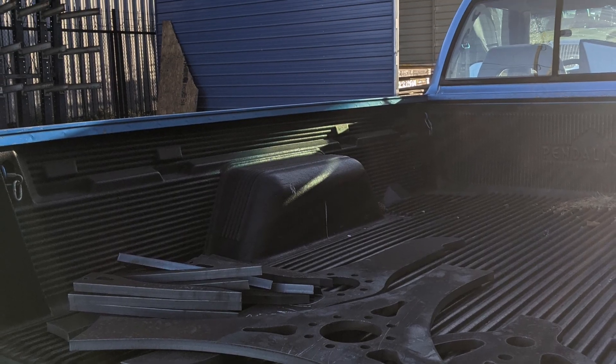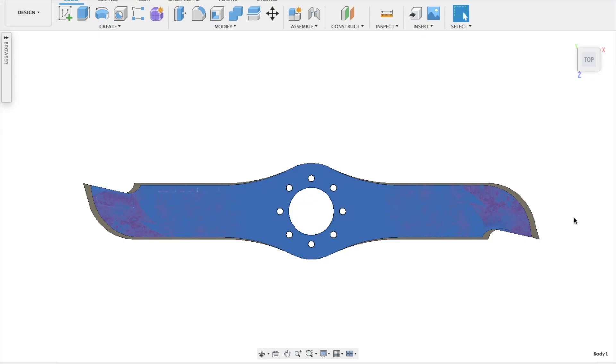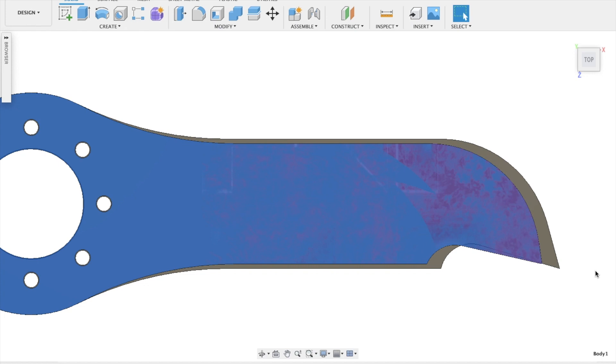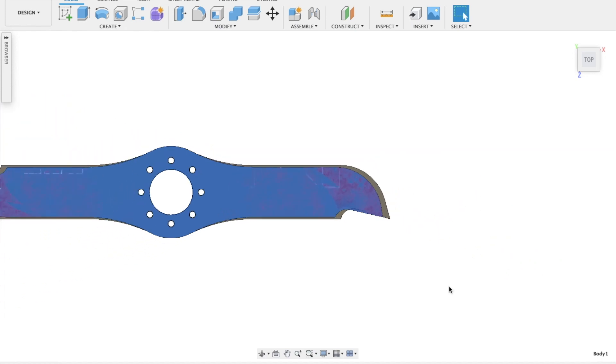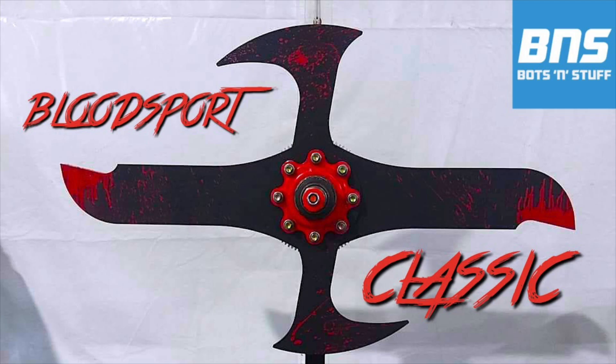Tell has supplied premium stainless steels, alloy, carbon steels, and more to the greater Los Angeles area for over 50 years. Huge thanks to them — make sure to check them out in the description. There are a few other differences for the new bar, too. This version is slightly shorter, and the rake and relief angles have been reduced slightly to improve durability while still retaining the aggressive profile and overall look. Early on we called this one the slightly less long bar, but that's a bit of a mouthful, and when production started calling it the Classic Bar, the name kind of stuck.